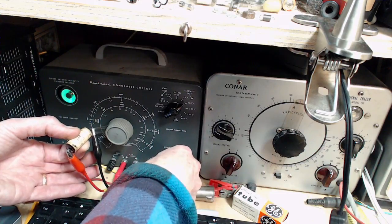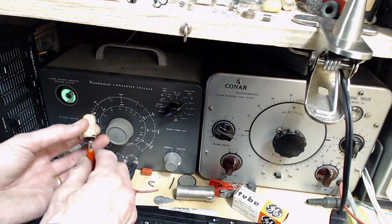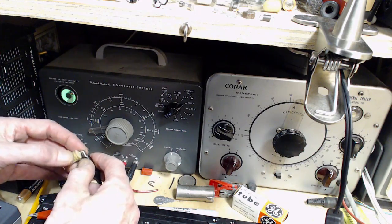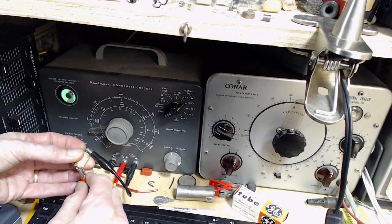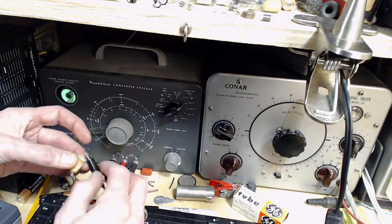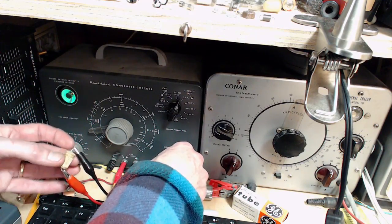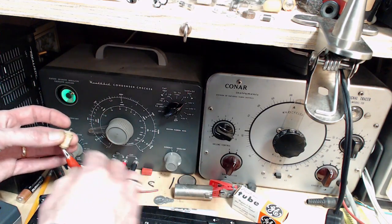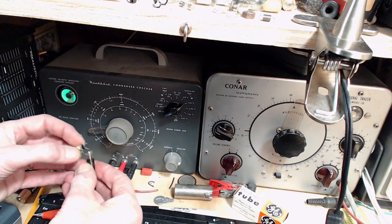Open partway on 50, no hope on 150. Yeah, so. I mean, the surprising thing here would be to find all these capacitors as good as new. Now, that would be surprising. This one's just a little different from the others. A different potting material here. 50 volts. Watch your finger. Partially open. 150, it won't open on 150. Very sort of consistent level of degradation.